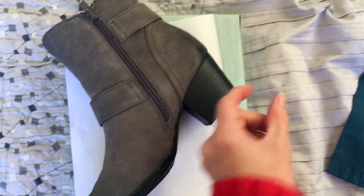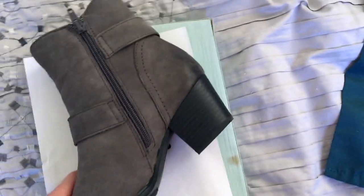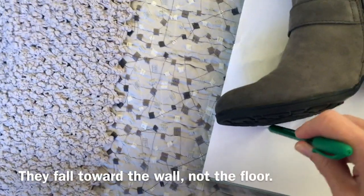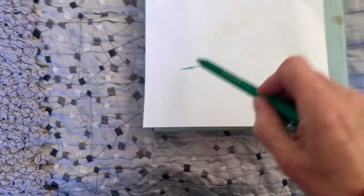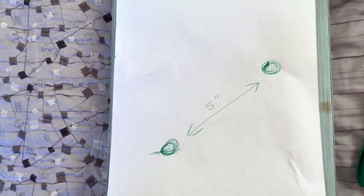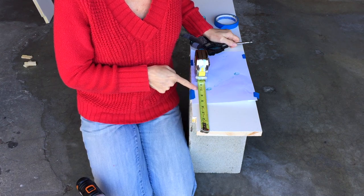It's okay if it sticks out a little bit — there's going to be curtains, so I have about that much play. That's about the angle that I want. I want it right there and right there — those two points. I'm going to drill a hole here and a hole here; they're five inches apart, and that is going to be what I base the entire template on. So my first railing is going to be seven inches up.